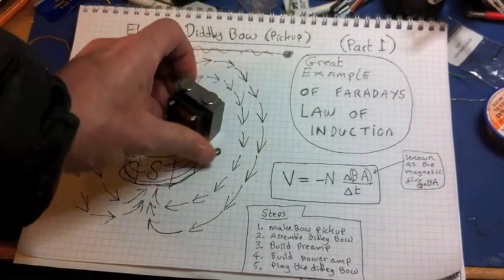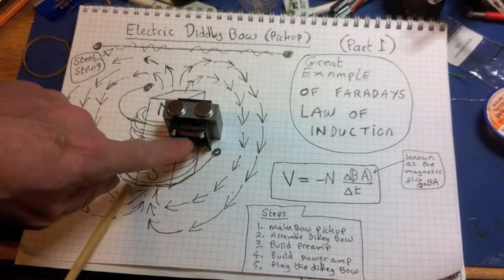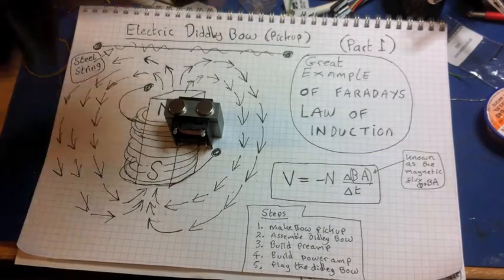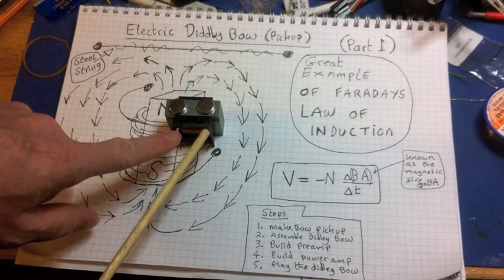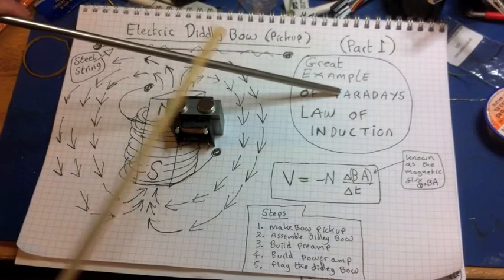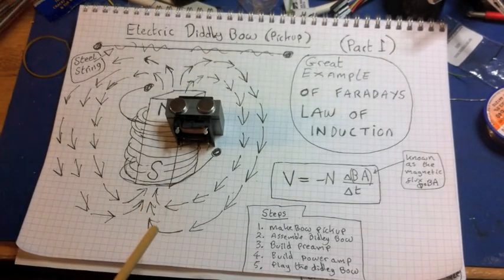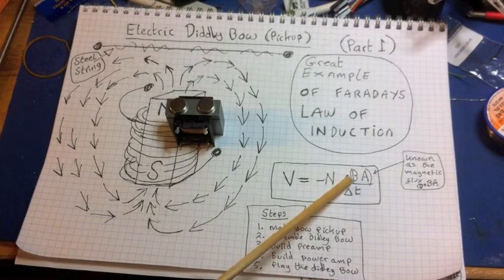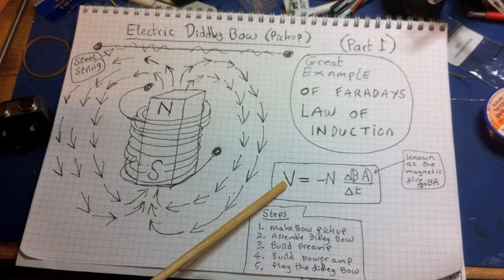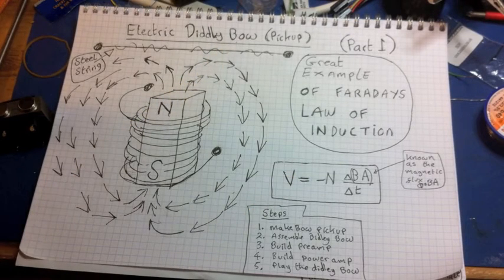Taking this, if we move some metal across here very fast, that's going to induce a voltage across these two terminals. The faster we move it, the higher the voltage. Get a magnet on top of this and move it against it — again, that increases the voltage. So if you imagine a guitar string and you pluck it, it's going to move very fast. When it moves up and down, it affects the magnetic field. Because the magnetic field is affected, this term in the formula changes — so using this formula, we get a vibrating voltage at exactly the same frequency as the plucked string.